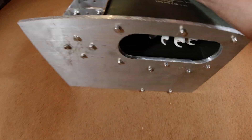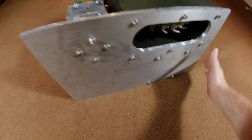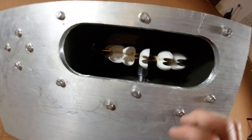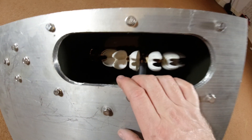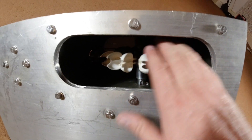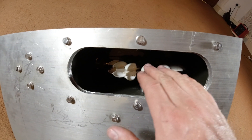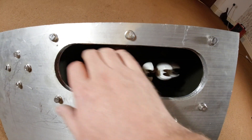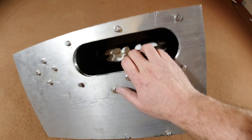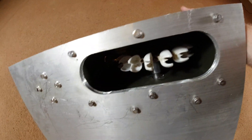If I just tip it over and look underneath — I've cut a big hole in the bottom, because you want the water to exit the chamber very quickly. You don't want it ponding underneath the wheel with the bottom of the wheel hitting the ponded water — that would slow it right down. There's a great big hole underneath so it can all drain out.